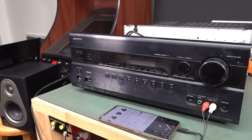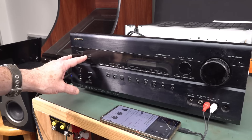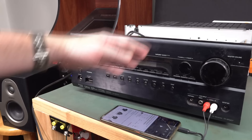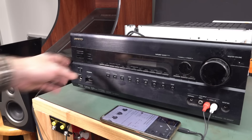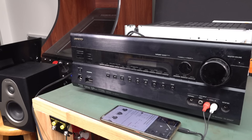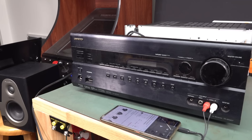So I guess, let that be a lesson to you — if you can check as much functionality as possible. Because, look, you get nothing on display, you might think okay the power supply's failed, but then you realise it's doing the standby thing, and I can hear relays clicking. You have a quick look inside and you can see that the soft logic button and the relays are controlled by all the digital stuff, and all that must be working. There's a lot of stuff that has to work in order just to have this button turn this thing on and off and switch some of the relays. As it turns out, there's a good chance that everything else — I choose the aux input and it works — the audio works. So it's definitely worth double-checking that before you chase a red herring down a bloody rabbit hole trying to debug the power supply. Looks like there's probably nothing wrong with it.